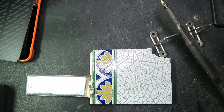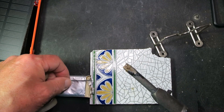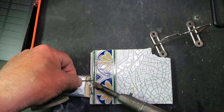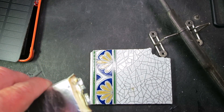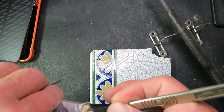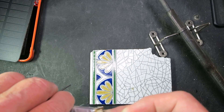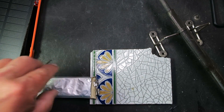We'll get our iron tinned and put the solder down. Yes, that is solder — last time I checked it had an 'l' in it. There's a good lean amount of smoke, and the solder has actually taken to it. With aluminium, if you saw this joint on a normal solder joint you'd say it was a dry joint because it's a very dull color, but that's just the way it is with aluminium. If you scrape the top you can see that it's actually a nice shiny joint.